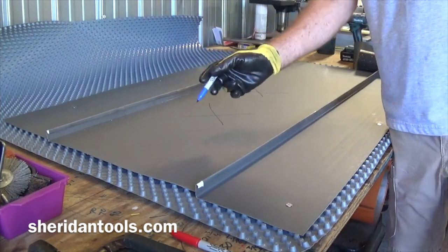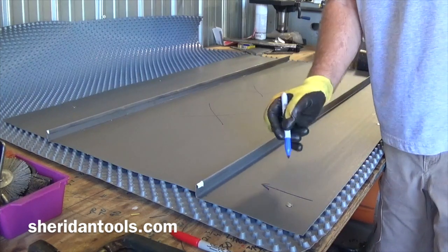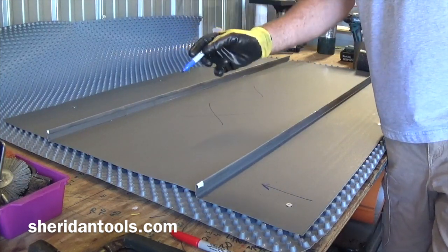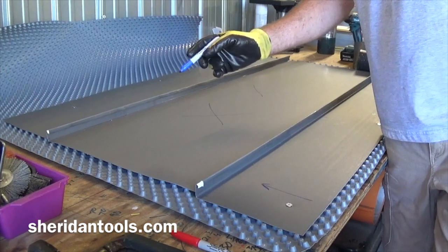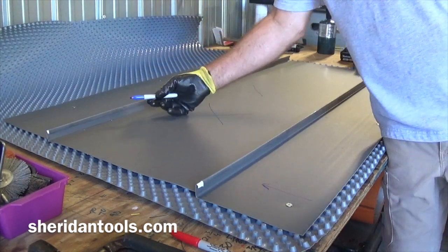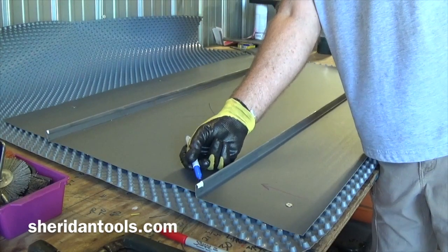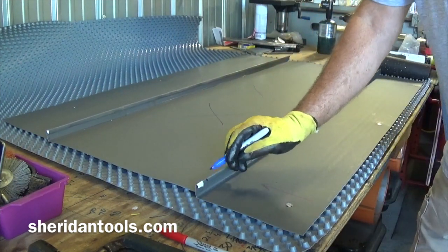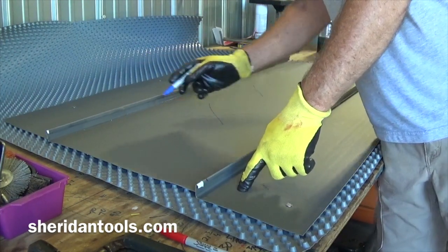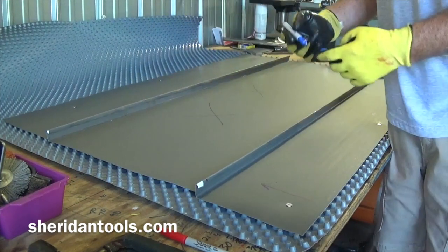Our roof was installed from right to left. So these panels were installed. This one was installed first, then this one, and then that one. So the critical seam that requires the most care when you're taking out a damaged panel is this one right here. Seam on this side, you're going to be throwing this away anyway, this part of this panel. So you don't have to be very careful taking that apart. You got to make sure that you don't damage this part of this panel, and you got to protect everything on this side, on the opposite side here. So, two critical areas.